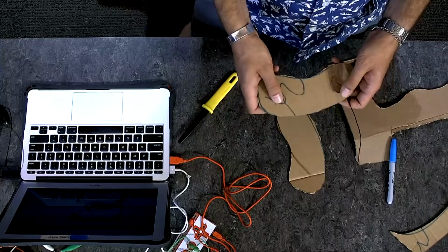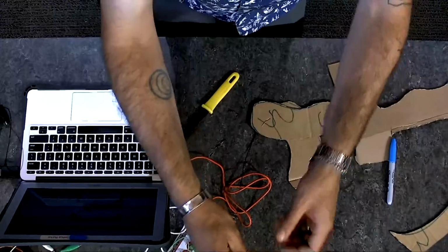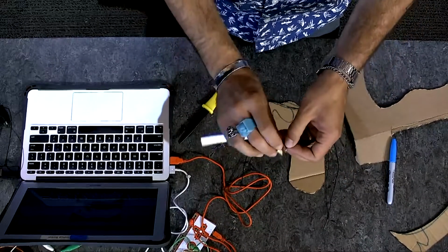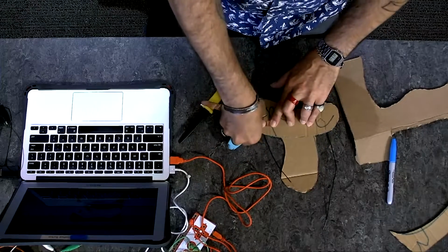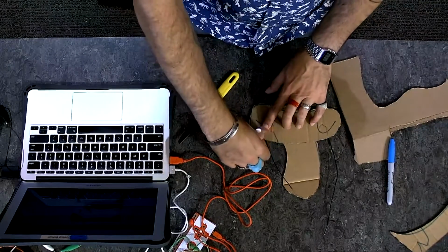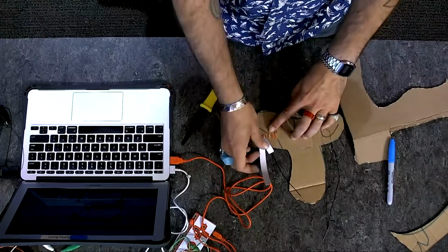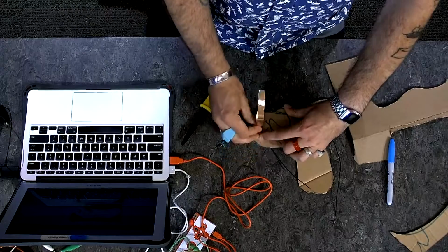And in the heat of the battle, I don't want to draw blood, at least not my own. So we could use some conductive copper tape to make a button. And you want to try and keep it continuous when you do this. So one way to do that would be to stick the tape down and capture that wire. And then, this is a kind of tricky thing to illustrate here, but if you fold it back opposite the way you want it to go, into a triangle shape, then you can fold it back on itself and pull the backing out, and it'll stay connected.